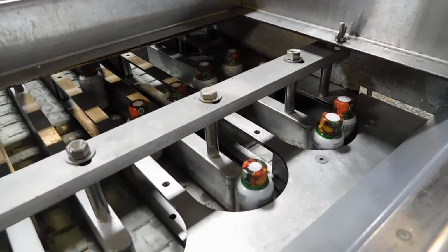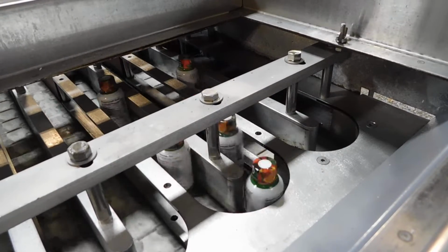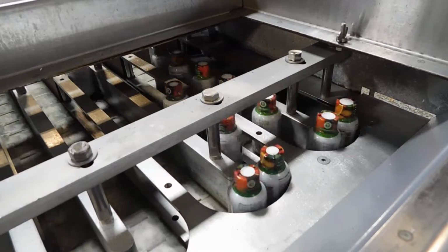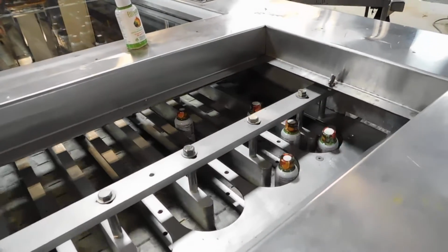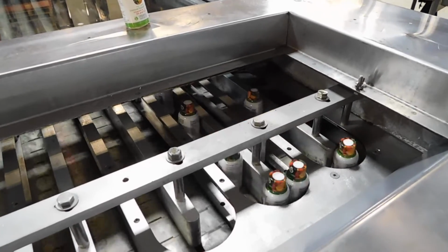As we talked about, we can up the speed of the system by changing the drive sprocket configuration from the drive to each one of the conveyor shafts. So that has to be done twice. It's pretty simple and easy to do just by changing the sprockets, making the drive sprocket larger than the sprocket which is on the conveyor drive shaft itself.